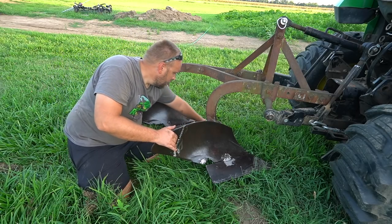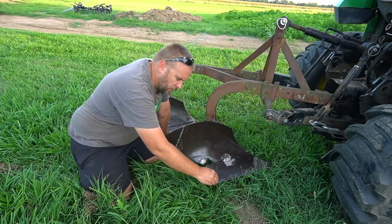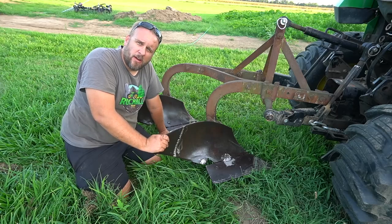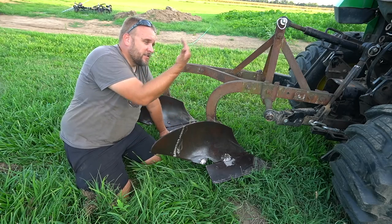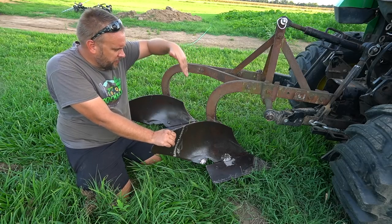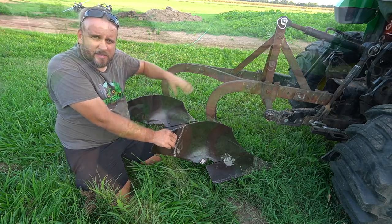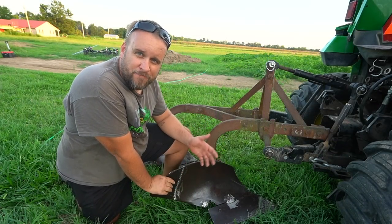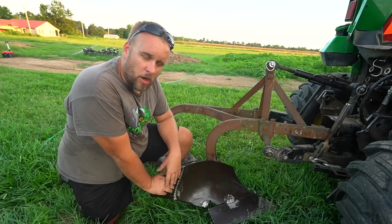Front to back, the point is touching the ground here, but the back of the mold board is maybe 3 or 4 inches off the ground. I should extend the top link and flatten that out, because the steeper the angle, the more it's going to bite and dig. The more you flatten it out, the less it'll bite. I think I've established that this is now flat and level — it's just a matter of finding out if it'll pull or it won't.